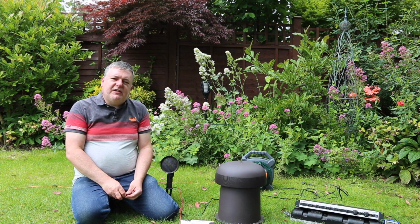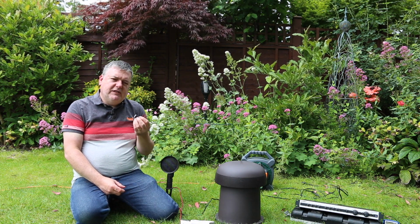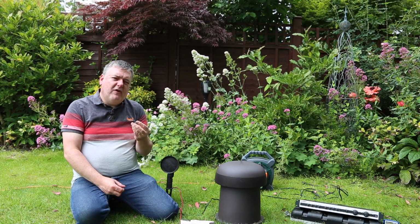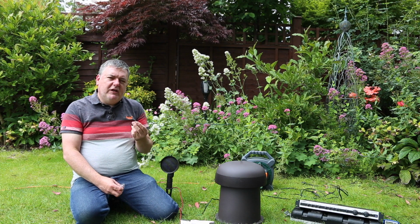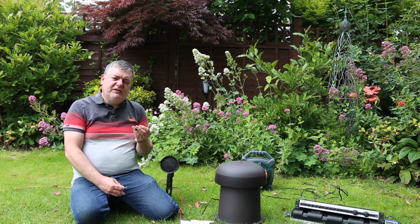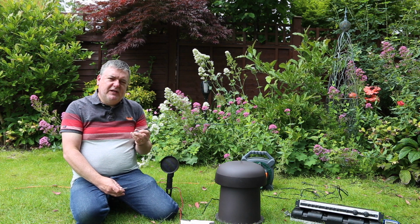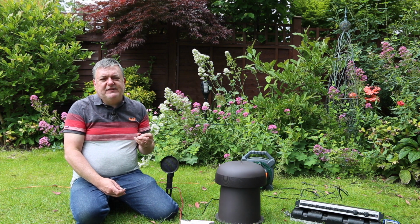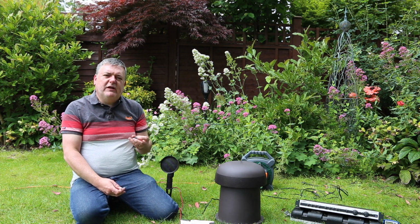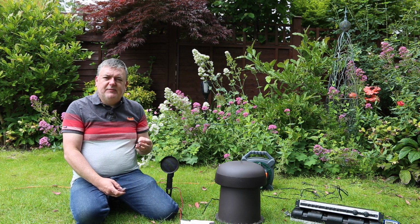When you're considering how to connect your speakers, you might be considering using the wire nuts that are provided in a lot of products. And they're absolutely fine for completely dry, arid environments because they're filled with silicone, but they're not really applicable to UK and Western European weather. Instead, you need to use a junction box that complies to IP68 regulations. IP68 means that the box is immersible with no fluid going inside, and that's absolutely essential for the fierce winters that we get, particularly in the UK and in Nordic countries.